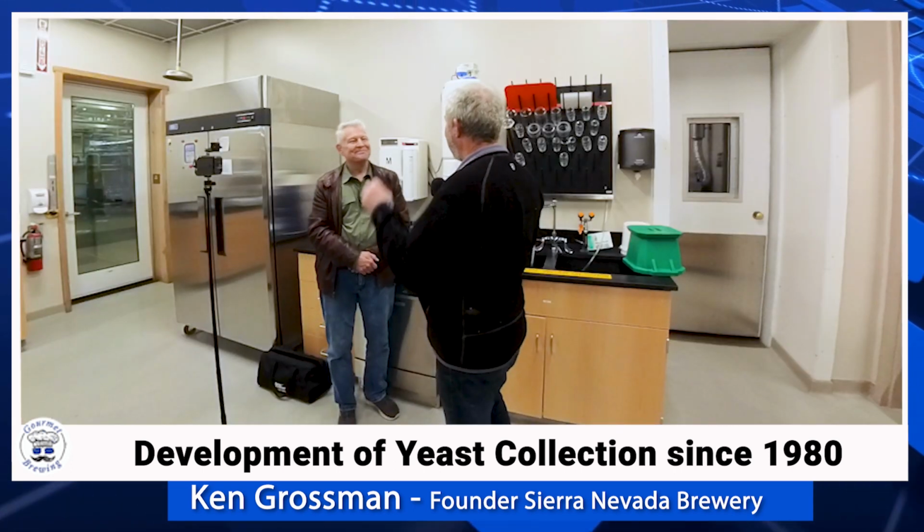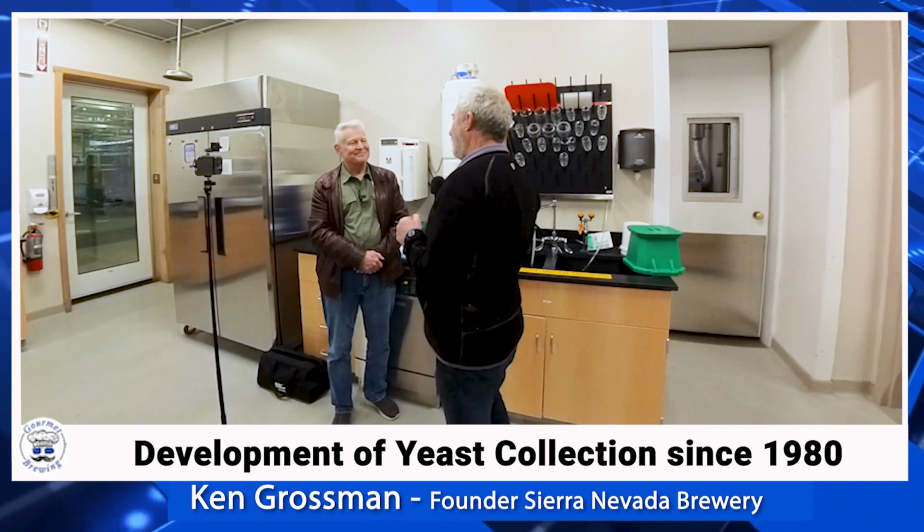So when we were starting to brew, we got in touch with those companies and got all the yeast they had. Then we started collecting yeast on our own from other breweries, from some European collections. I've got logs of us back in the homebrew days of having our own yeast collection. We learned how to plate and culture as homebrewers, in the late 70s. We still maintain our own collection of yeast strains today, and we propagate up from a slant. Essentially from a single cell, we propagate those yeasts up into pitchable quantities on site.